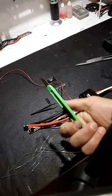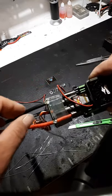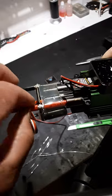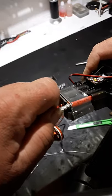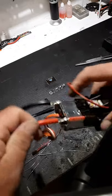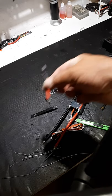So I take my little razor blade - cheap, 99 cent razor blade - and you're going to cut some of this plastic right here. Look at that, already done. We're going to take this little plastic piece and trash that. Now what do you have? You have your solder joint showing right here and right here. The plastic is still around there holding everything together - holding all these caps and stuff together. So you've got your solder spots. I know some guys were talking about cutting right here, but there's no need to do that. If you grab this wire and pull it back, you can expose it - and see the other side's not pulled back, it's just shrunk in there. So you expose your wire on both sides that way without having to cut it. Then you can pull your wire back down and get it back down closer so it looks clean. I pre-tin these.